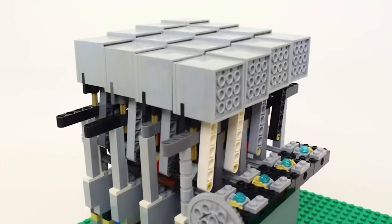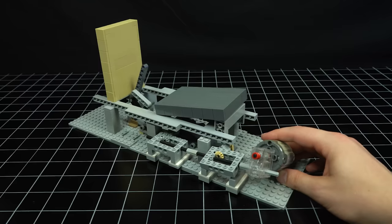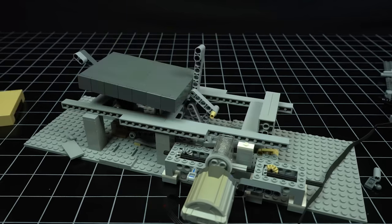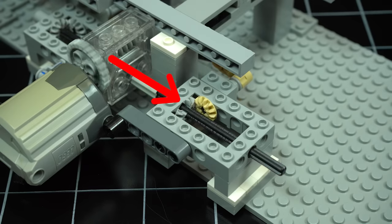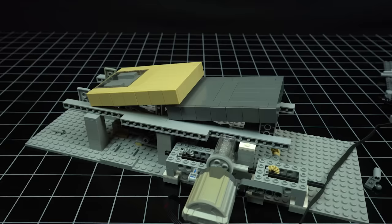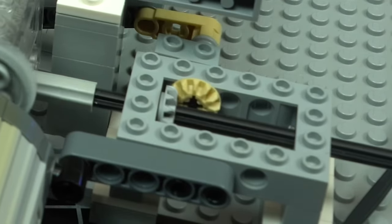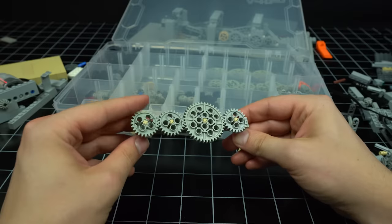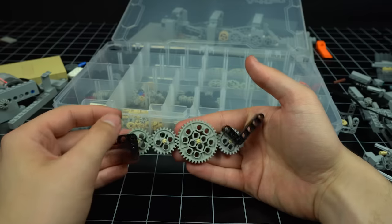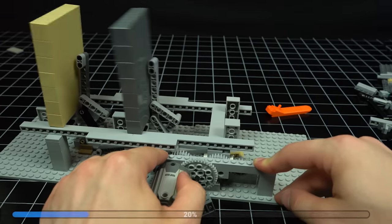I'm definitely going to use this toggle on a future project. If you're interested in keeping up with what I'm building, you can join my channel to see semi-regular work-in-progress updates. I need to figure out how to make multiple dominoes be powered by a single motor. Moving the motor between the gears helps, but things are still too springy. There is so much force that a gear snapped. Turns out that Lego axles can store lots of energy when twisted — the tension buildup in the axles is what causes the dominoes to launch.